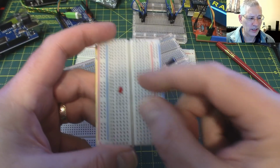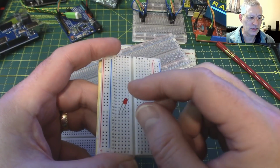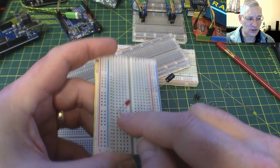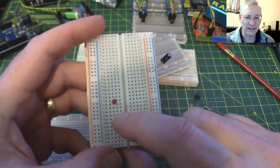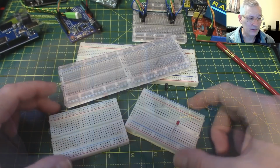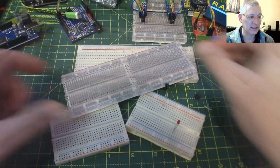because sometimes things wouldn't be working right. I'd just wiggle a component and suddenly it would spring into life, which tells me either it wasn't making contact, or the grasping little header pin, or socket rather, in there had corroded. And I'm happy with these now. I've kept the good ones that I've had. Great, that's the first thing.